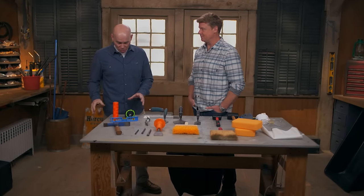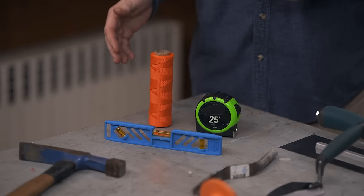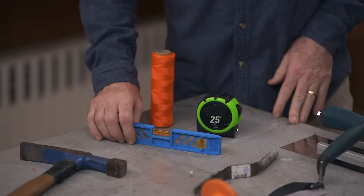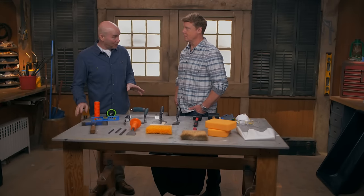What do you got? Start with, you need a tape — obviously you're going to need to measure stuff, that's what the tape is for. This nice bright line right here is going to help us get a straight line from A to B. Pull it tight and just lay right up to it. This is what we call a torpedo level. I use a two-foot level and a four-foot level, but for a homeowner, a torpedo level is perfect.